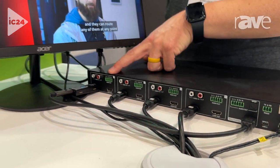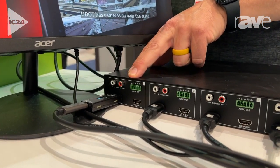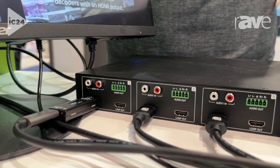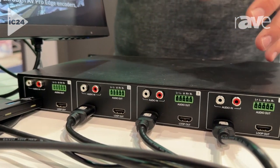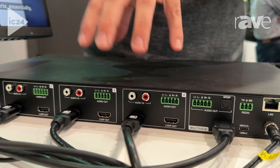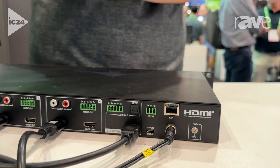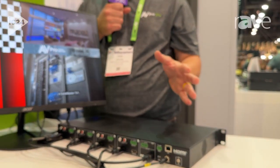What makes it special is that you have HDMI loop outs and audio breakouts for every input. This allows you to loop this product into the other AV over IP products and matrix switching products that AVProEdge offers. So now you can deliver to your customers a four input, 4K60 multi-viewer screen throughout any of AVProEdge's video distribution solutions.